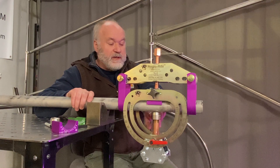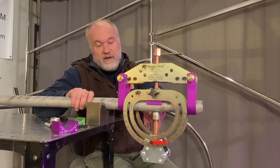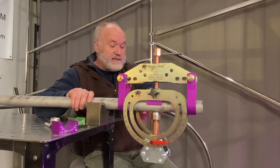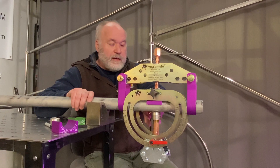The procedure for this welding is spelled out by the manufacturer of these fittings — like Bonney Forge has a video showing the proper root gap. We've got it set up with a small TIG welding rod here to produce the root gap we need.